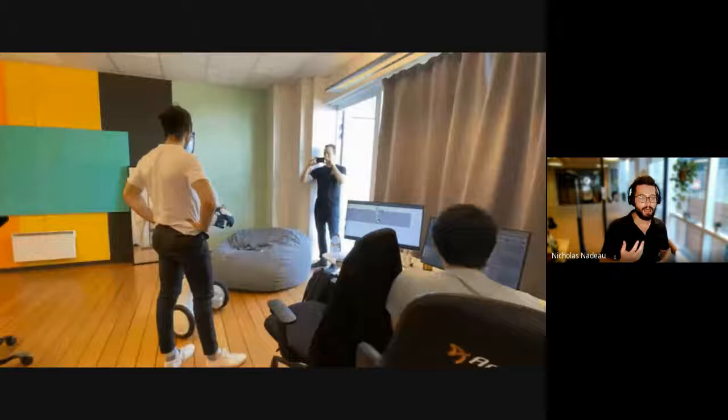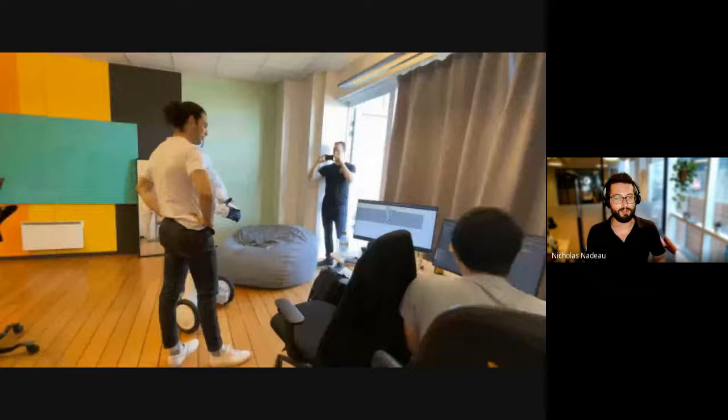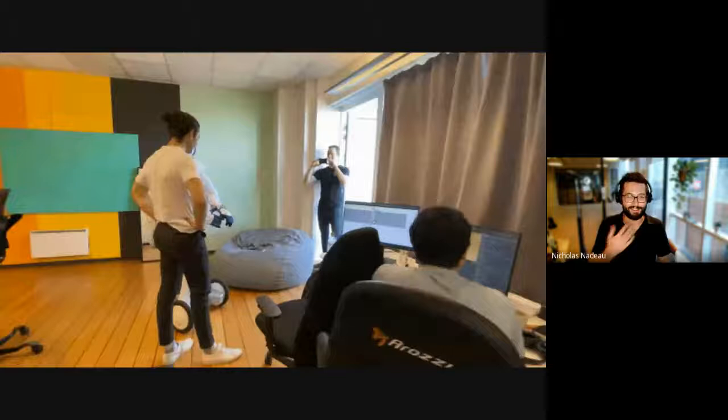And so if you remember from some of my PhD work I did before, it brings up the idea of safety in the context of different events. In a lot of robot applications, simply stopping the task is a terrible idea because you get into a clamping scenario. And so, for instance, with the KUKA LBR robot, if you simply stop the probe, yeah, you're clamping the human, but the human can also not back drive the robot due to that high transmission ratio. And so this is not a safe scenario at all for humans in the loop.